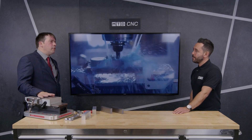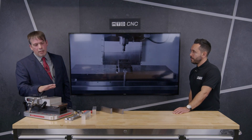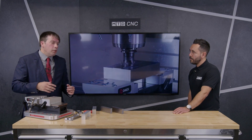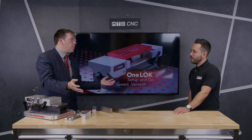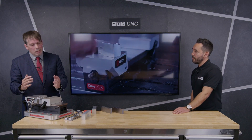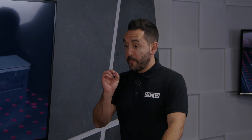This is the Mark II. The first thing that stands out is that the fixed jaw is at the front, not at the back. There's no technical reason why you have to have the fixed jaw further away from you, and there is actually an advantage to having the jaws the other way around. On the 500 millimeter version, when you're doing small components and the fixed jaw is far away from you, you're reaching right into the machine — it's more difficult to see when there's coolant and shavings flying around. So there is an advantage to having the fixed jaw closest to you, especially when doing smaller components. It does take a little bit of getting your head around, but it's completely unique.